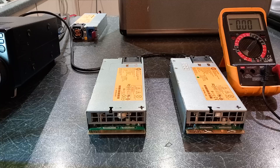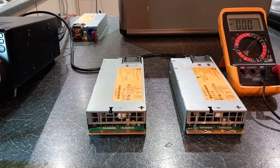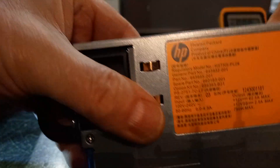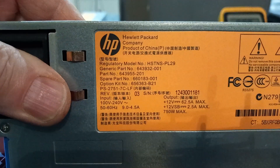One of them — I think it was the DPS 800 or maybe bigger — I use it on a TS-590S. It's modified so that it's variable and will sit happily at 13.7 volts all day long without overheating. It can be used and abused.